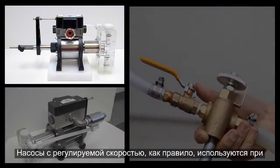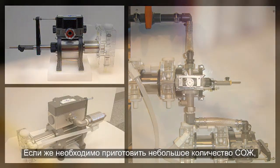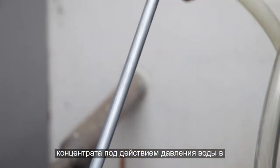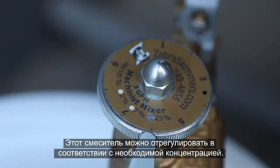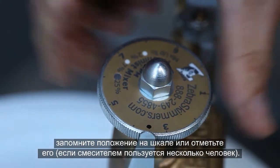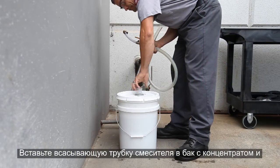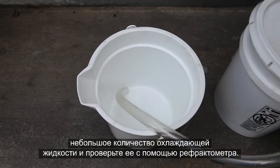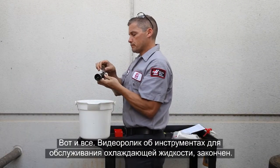Proportional pumps are usually used when higher volumes of coolant need to be made frequently and when coolant needs to be pumped over longer distances. When lower coolant volumes need to be made, the Venturi mixer is the less expensive option. The mixer uses water pressure to draw a metered amount of concentrate up into the water stream, where it mixes completely with the water as it's dispensed. The mixer can be adjusted to output a range of concentrations, and once you've found the setting you want, note the position of the dial or mark it in case someone else adjusts it. Place the mixer's suction tube into the concentrate container and connect the mixer's water inlet hose to the faucet. Dispense a small amount of coolant and check it with your refractometer. Once you have the mixer adjusted to your satisfaction, you're ready to mix coolant.